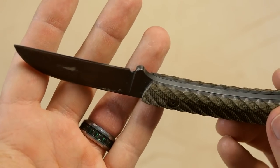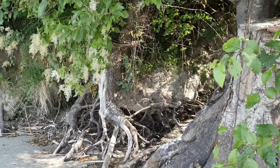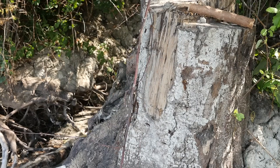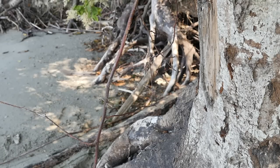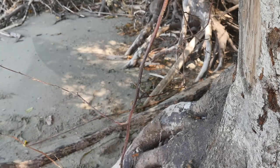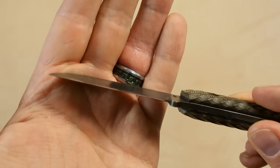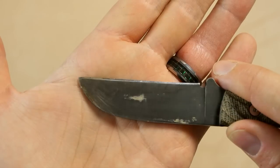You can see the gun bluing has rubbed off a little bit, and that's because I decided to throw it. I know — why on earth would you want to throw a knife like this? But I find it's a very good way of testing the material, because throwing puts a lot of stress on a knife. If there's any weakness in the handle, blade, or the tempering isn't right, it's going to crack or bend. And nothing like that happened. The edge was dulled from repeatedly throwing it into a wooden stump, but it has no actual damage — it just needs resharpening.